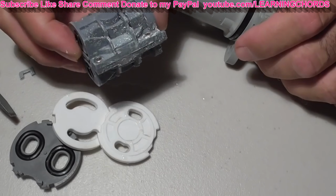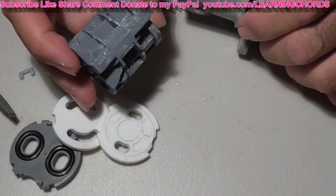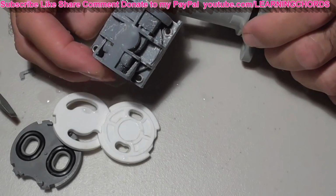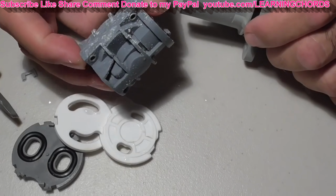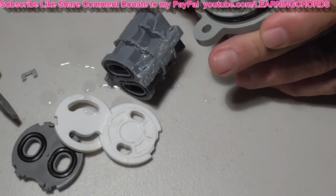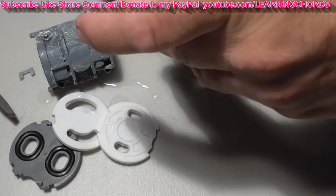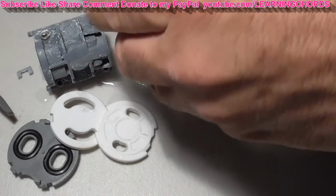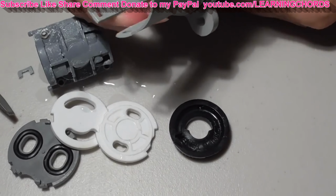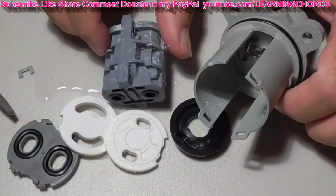Okay, so now, that gives you an idea. Not too bad for 20-some years, considering the water is extremely hard in there, but I don't think that would cause that much trouble. The sediment, the dirt that you saw come out of this unit and onto the tub, all of that gravelly type material, I think that is what caused the binding of the valve. And then we have this inside part over here. This is the temperature control piece, and the model number, and that's really about it. So that makes the inside of the valve balance cartridge.